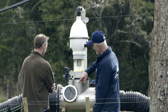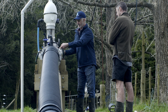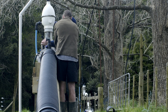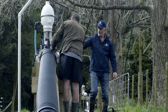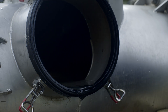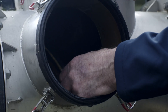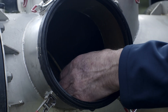If we need to get in there to the non-return valve, we can release these catches here — it's sucking itself on at the moment. If you hold on to that glass thing, I'll let the air in — and it'll dump water on your gumboots, so watch out. So there's the non-return valve. Because the valve is closed down there, I can let air in and that valve will open. That will suck a bit, but only because the valve is closed. And now this valve will be loose because it's the same pressure on both sides. This is very, very light — just a fraction heavier than water — so when the flow is on, it lifts right up here, right out of the way.